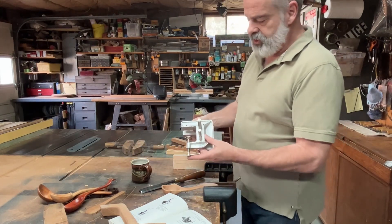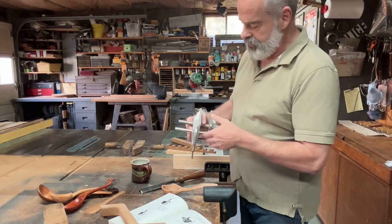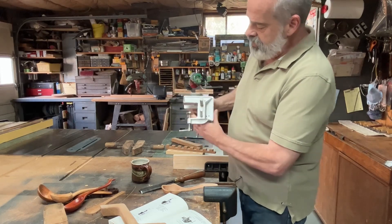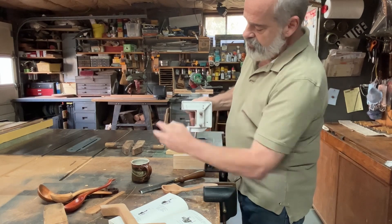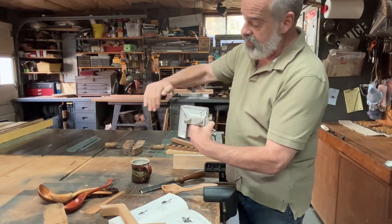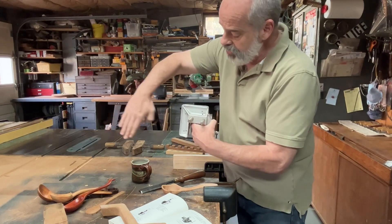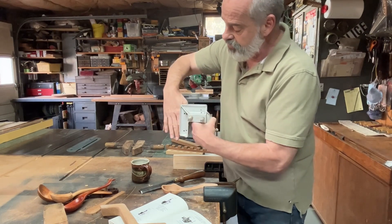It's a very simple vice. It's got a lead that goes through here that keeps it straight, and then it's got a screw thread that tightens it down, so they're running parallel. The shape of the vice is an L-shape, so that it can fit onto a bench or a sawhorse. You could put a board in there and plane it on the sawhorse, or take a door and stand it up at the end of the sawhorse to help keep the door from pivoting as you plane it.